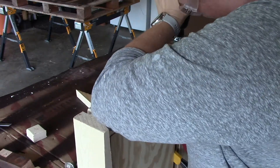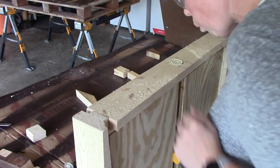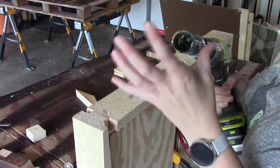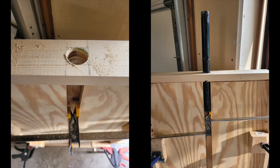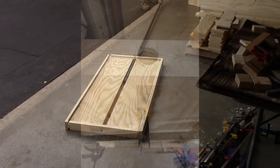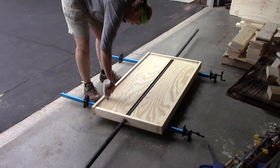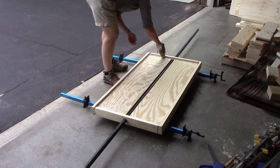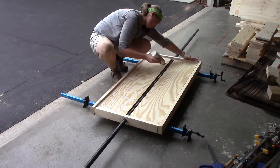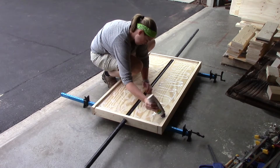To make this hole I'm using a 1 3/8 inch hole saw. You will need to cut this hole on both ends of the table. When you're finished it should look something like this and you should be able to do a little test run with your pipe to make sure it goes all the way through with no catches. I kept the pipe in there for the next step. I'm applying glue to add the top piece, being very careful not to add glue too close to the pipe so it doesn't fall in there and cause issues when turning it.